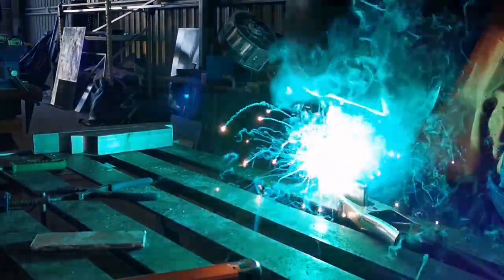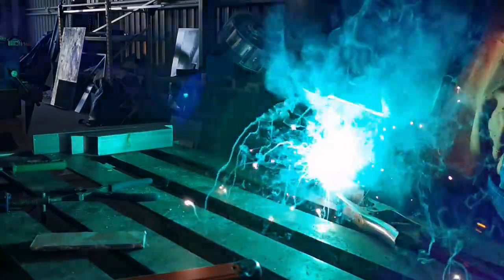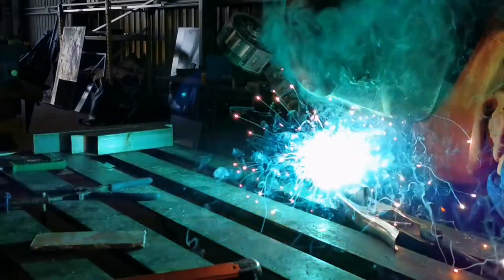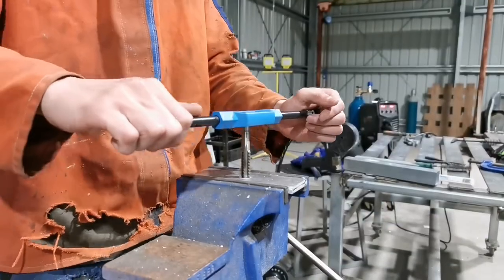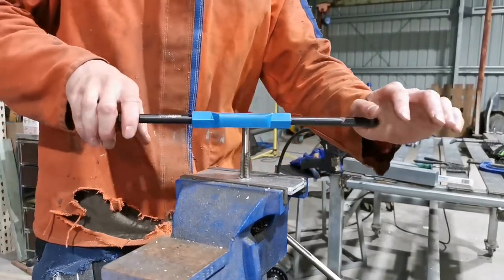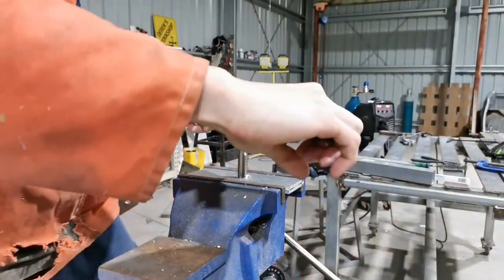The cap of the post, that is where the M14 bar sits, is made of two plates of 4mm aluminium, and it becomes 8mm. And 8mm provides enough thickness for me to cut some M14 thread.